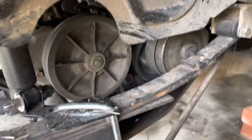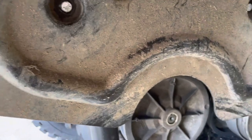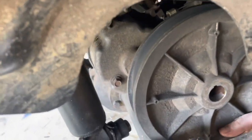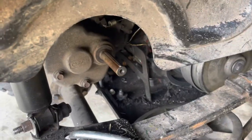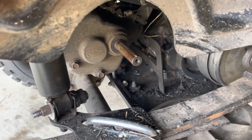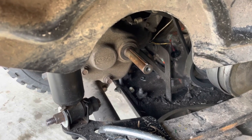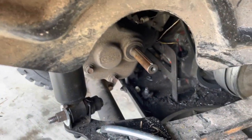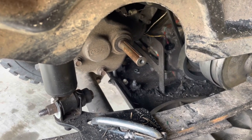So we'll take that off real quick. Again, I've already done this once — I'm just doing this for video purposes. It rolls off and the clutch slides out. What I did is I took a couple days where I would spray the shaft and let it sit in some lubricant spray, come back and spray it again, then I just put a crowbar behind it, gave it a gentle pop, and it actually came off. Some people have a lot of problems with these — they have to heat it up or end up having to cut it off. Luckily this one wasn't a big deal.